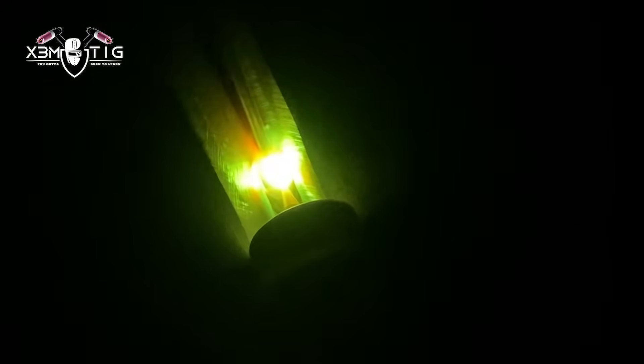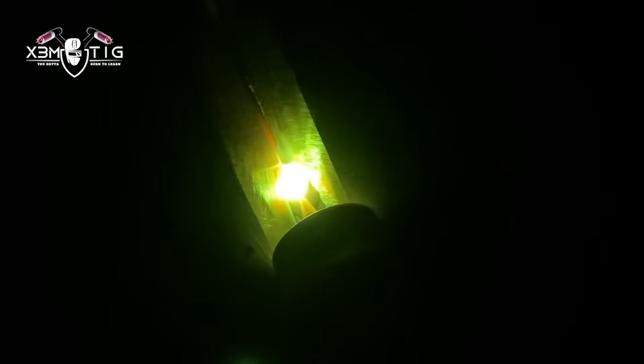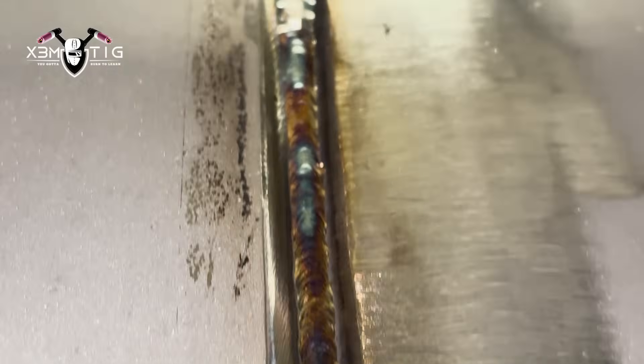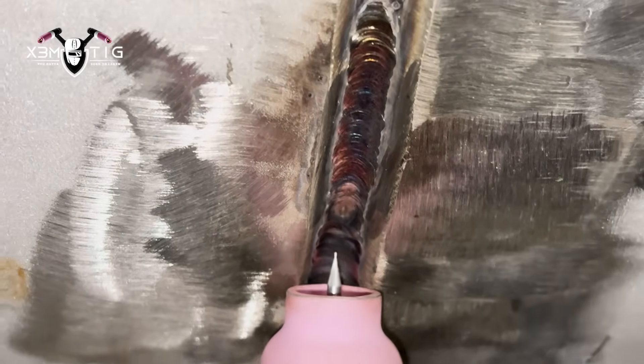I just dip right in the middle, slow down — these are slow steps. It's only a section from about ten o'clock all the way up to twelve, that top section that's closed. Usually I go with bigger tacks, and I had pretty good tacks, but there were spots with high-low where I didn't put tacks and then it shrank a lot. Even so, it's doable — just go up on heat and no worries. You don't have to use a grinder, especially when it's in the shop. If anything goes sideways you can always start again.